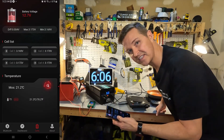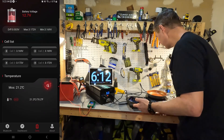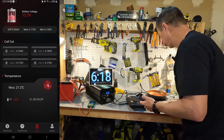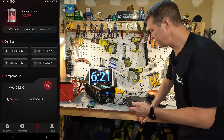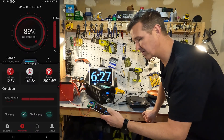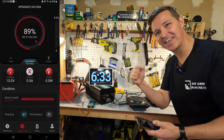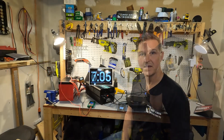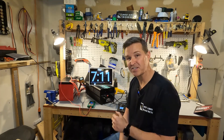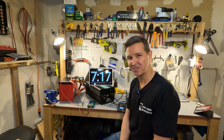Let's juice this up by introducing 600 more watts at the 6 minute 20 second mark. The amperage hit 161 amps and after exactly 10 seconds it shut off — perfect. About 30 seconds later the battery clicked back on and was ready to go again without me having to do anything. I love those results — exactly as specified.